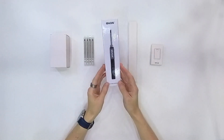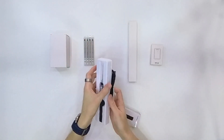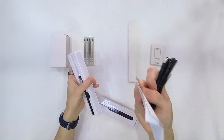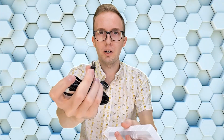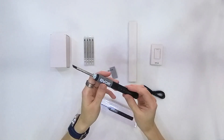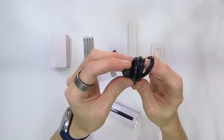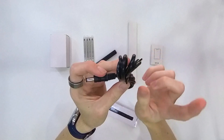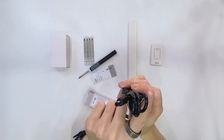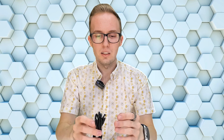Let's start from the main point — the soldering iron. Here we have a manual, a USB-C to DC barrel cable, and the soldering iron. There isn't much in the package, but what is interesting is this DC input port. We receive a USB-C to DC barrel cable and we can power this soldering iron from USB-C at 9 to 24 volts. So if you have a high-voltage USB power supply, you can use up to 24 volts and the soldering iron will heat up really fast in just a few seconds.